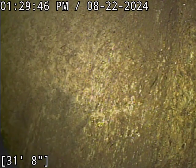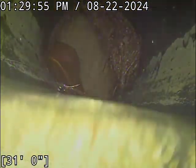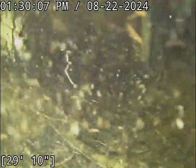I don't know if we're going to do a drop straight into the top of the main or if the line's going to continue on out into the road. We're going to let the water drain out here for a minute. We'll inspect that portion of the line, and then we'll advance out to the other cleanout. All right, so I've located this here. I can't really put accurate depths or anything down. There's an open hole right here in the ground, and I really don't want to go standing on top of that. It won't be a terribly accurate depth anyway, because the ground is wide open. The top portion of this whole concrete column is completely exposed. You can see it if you lift that plywood up.